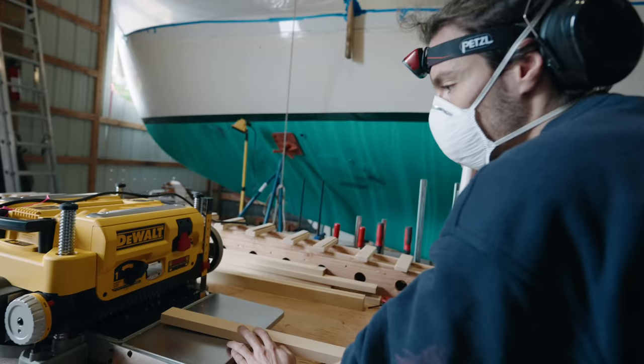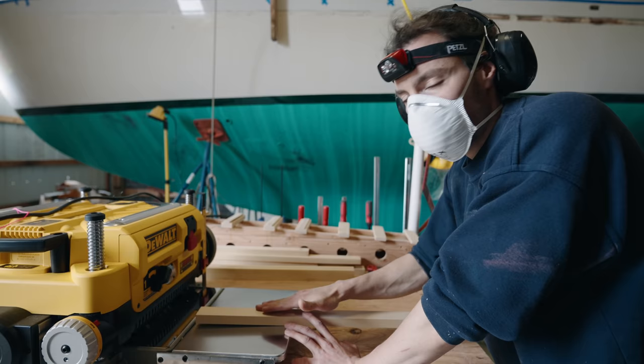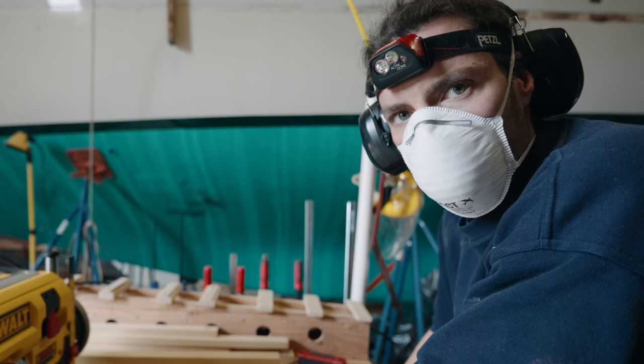And also it has two different speeds. The slower it feeds through, the more cuts are being made on the wood, and the result is much, much, much nicer. I am debating if I want to do that or not, but I think I don't, because I'm gluing them, and for gluing, on a microscopic scale, I want a bit of a rougher surface.